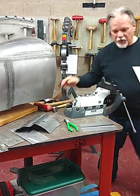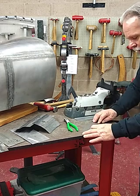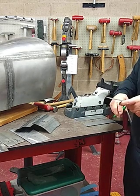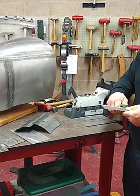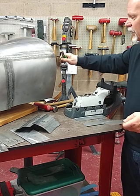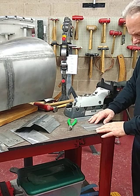We go back and check the fit against one of our previously lipped panels, and we can see we're pretty accurate as far as our fit. In some cases if we have a little shallowness, we can either go back to the fixture or use a small seaming plier — we call it a DSE F 45-22. Really good for adjusting lips. The key is to get your panels relatively aligned — they don't have to be perfect, but pretty close.